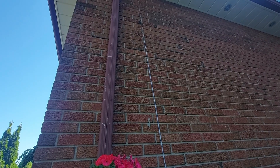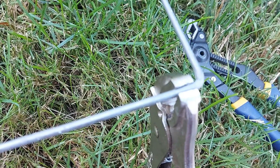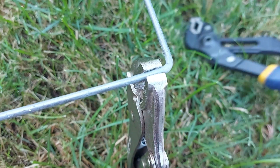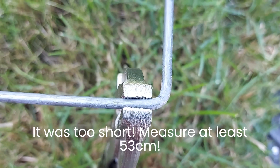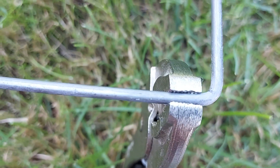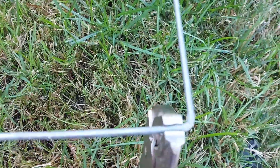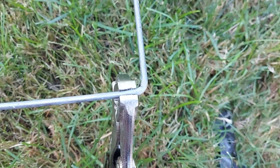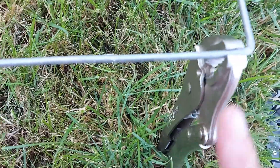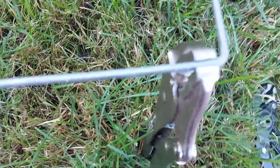Keep in mind you are not going to bend this wire with your bare hands. I'm doing this with very simple tools. What I did was measure 50 centimeters plus about five millimeters for the bend, scored it slightly with a hacksaw, then locked the longer arm in the vice grip and used another tool to grab the shorter piece and bend it - so the cable wouldn't wiggle in my hands.